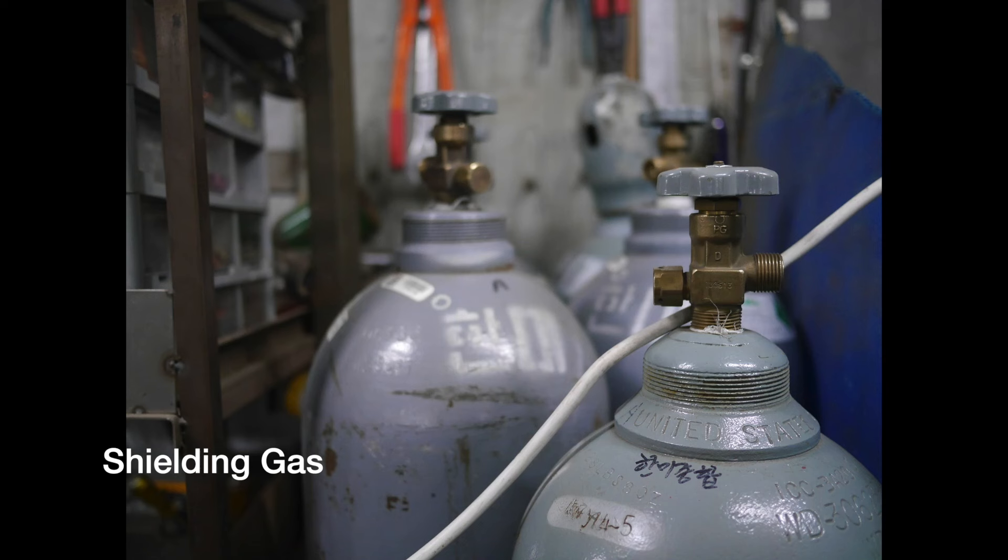You can wear all the protective equipment and those BBs are very good at finding any kind of way to get in. Another really big part of safety is UV light — welding the arc puts off a lot of UV light, and you want to be protected from that. When you're welding, you are using shielding gas for MIG, TIG, and even stick puts off its own shielding gas. Those shielding gases are inert gases, and what that means is that they displace oxygen — that's what we breathe, so if it's pushing it out, that's no good. You want to make sure you learn about ventilation and what a confined space is, when you need forced ventilation. You should be learning how to safely use and operate a container of gas, because those containers, if the valve breaks on them, they shoot off like a missile. So you want to learn how to safely set them up, store them, especially when it comes to fuel gases like acetylene — that is a very, very important part to learn.